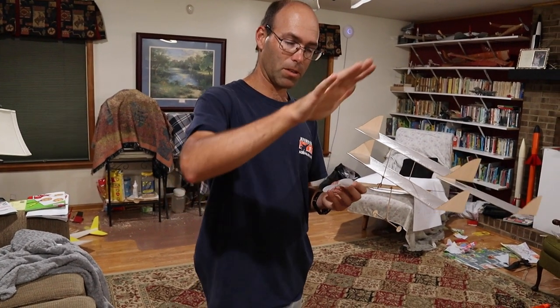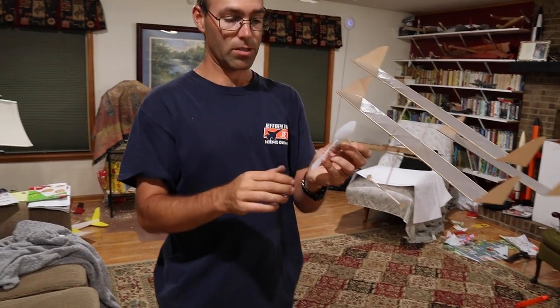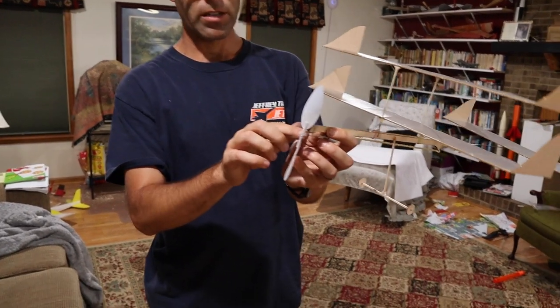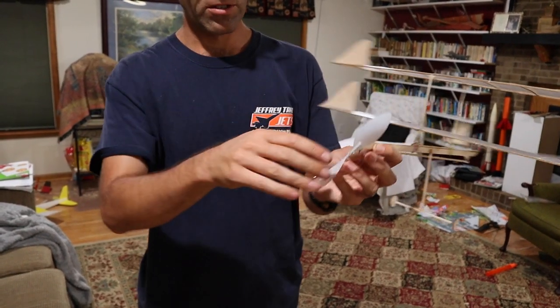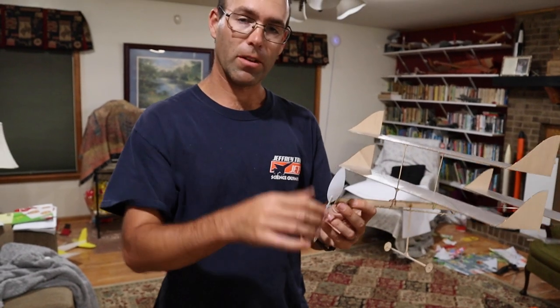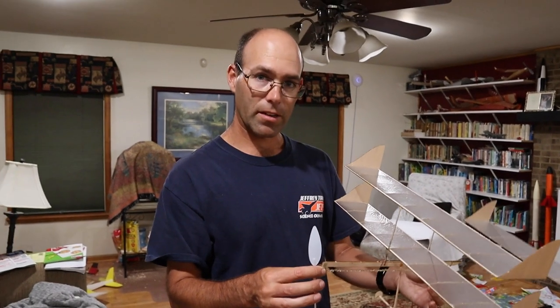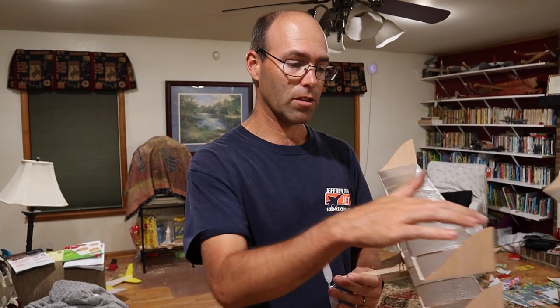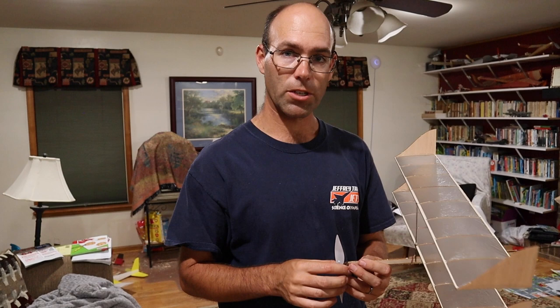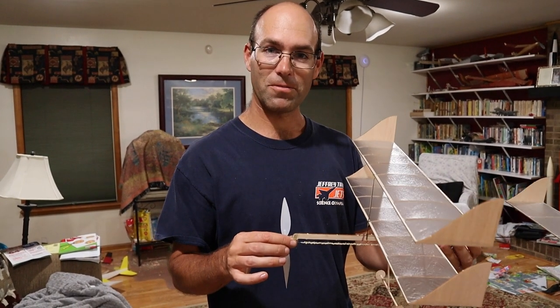So if the airplane comes up and stalls and settles back, you're going to want to add some down thrust to this nose bearing. So what you would do is take this front part and bend it down a little bit so that the propeller points down a little, and that'll cause it to pull down and keep the airplane from stalling as easily. Other than that, your main thing at that point is to start concentrating on optimizing the flight profile of this airplane. We've got some videos on doing that, so I would recommend you look through the rest of our channel for that. Other than that, at that point, start enjoying flying your airplane.